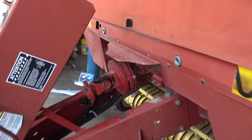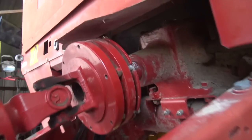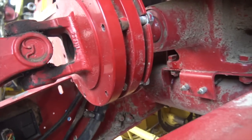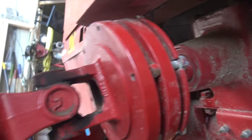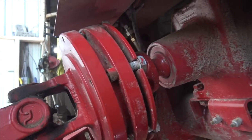We're doing something I haven't done before, which is messing with a slip clutch. This protects the driveline from shocks and jolts. The problem is if these things sit for a while — I believe this one has, and probably hasn't gotten this treatment since between 1998 and 2002 when they made this baler. According to the manual, you back the bolts off the specified amount — in this case five turns — run the PTO for five seconds at a time, and it breaks the discs loose from sitting. They get really hot, and then you tighten the bolts back down.